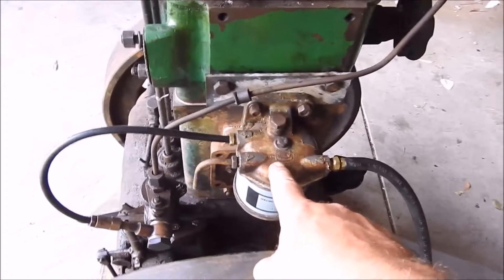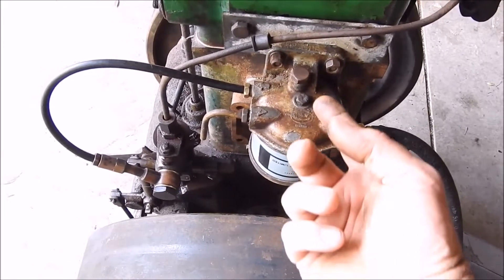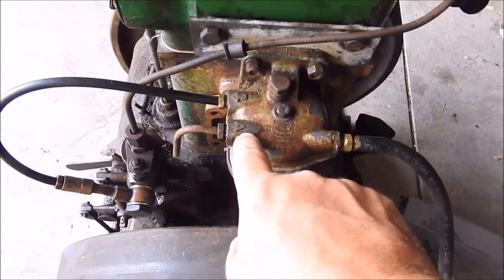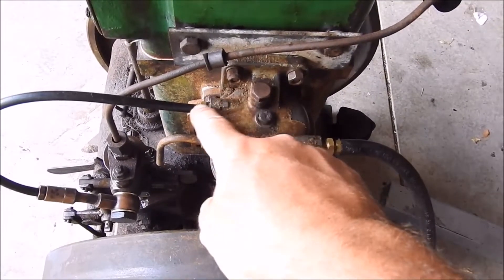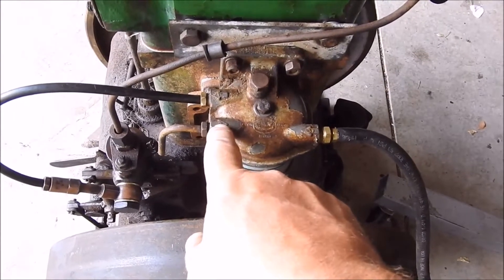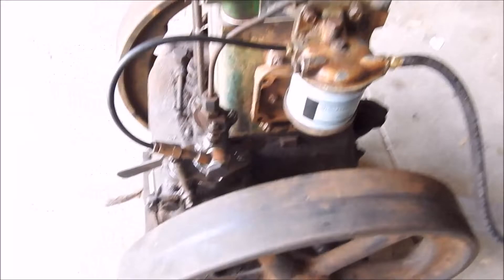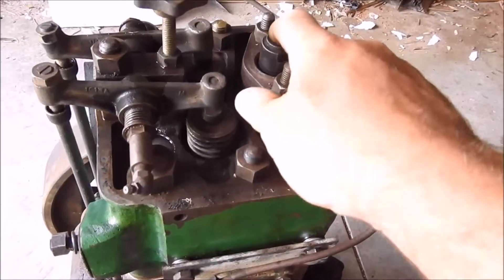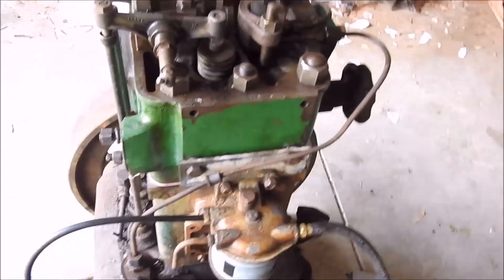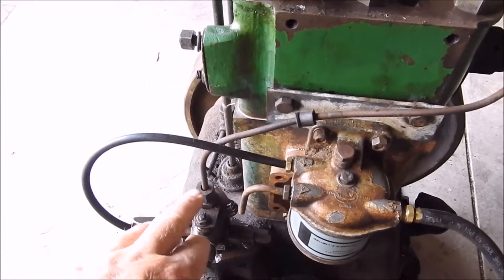The fuel coming in goes down around the outside of the filter, comes up the middle and out to the pump. But when you actually take the filter apart, it just goes straight across and out - so the fuel wasn't getting filtered at all. The fuel pump is actually in really good nick. But the injector nozzle was completely stuffed - it was just spraying straight. I tried cleaning it and it made no difference whatsoever. I put a new one on there and it's spraying perfectly.